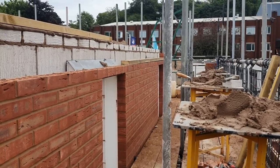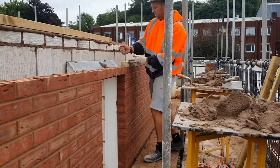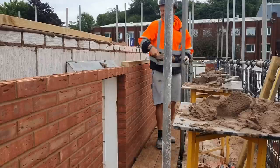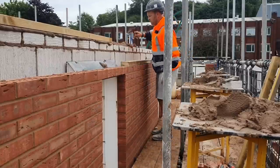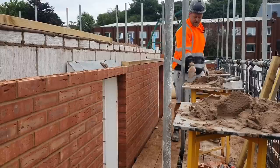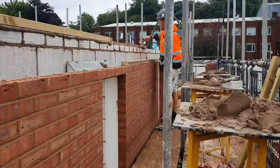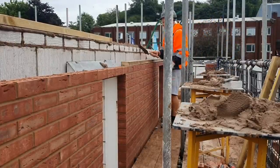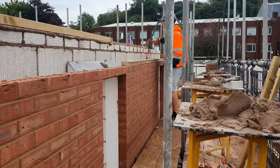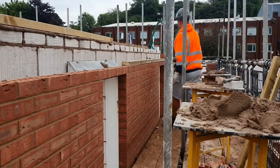See if that'll hold. Right, what we did is I pushed this to the end of that wall on the inside and then just cut it through. Get this spread across. I'm hurrying myself up. Check the height, it should work perfect. On the drawing it says 2437 from that floor. So I'll double check it once I've bedded it on, but I think it's pretty darn close.